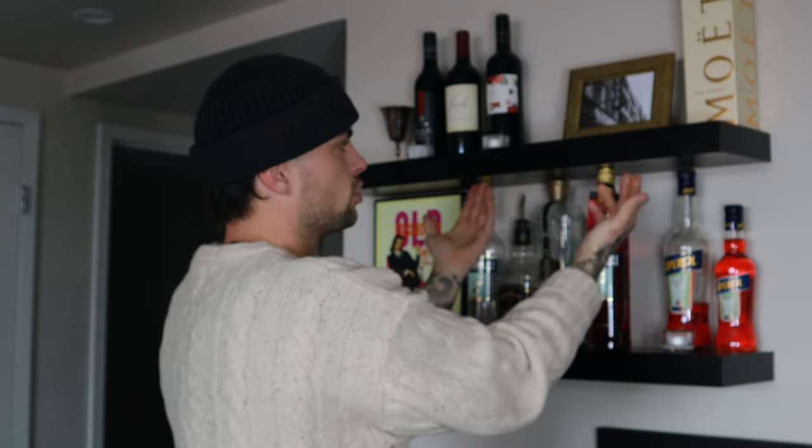It's the next day and the shelf is up. I think it's beautiful, but the top one is really crooked — it leans forward. Like this bottle fits at the back, and when I pull it to the front it gets wedged in and the shelf is just sagging. I realized it's because the bracket is bent — I should have flipped the bracket the other way so it would bend up, and when you sit things on it, it sits flat. I actually had to do that for the bottom one and assumed the top was the same, but it was the reverse. I think I might just have to live with it because there are so many holes in the wall already, but whatever — I love it.